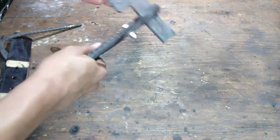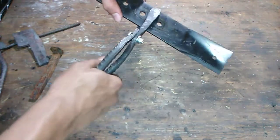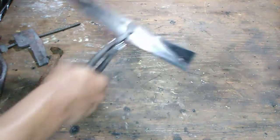Illuminati confirmed. Thicker metal pieces like this, you just choke them up there in the tongs, and they work great. Thinner metal, 3/16 inch, just reach the tongs across, and it holds nice and tight. That's great. And then railroad spikes.